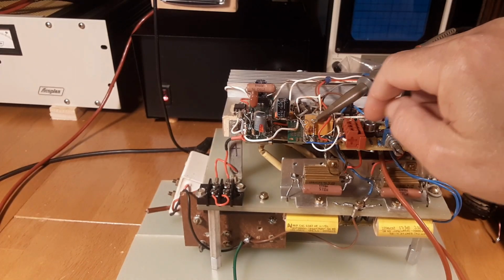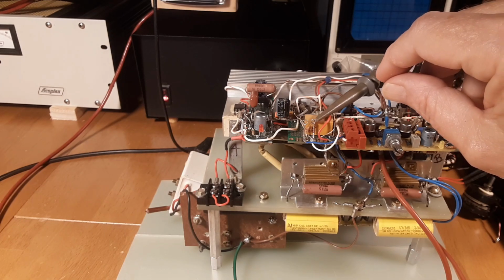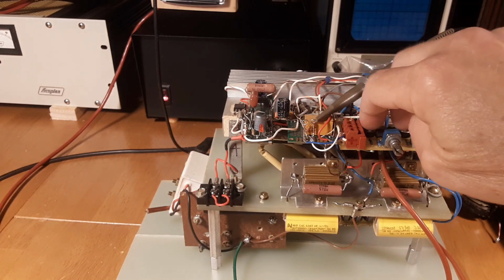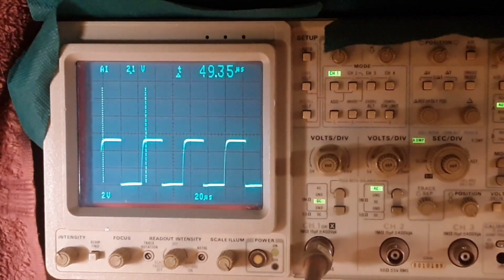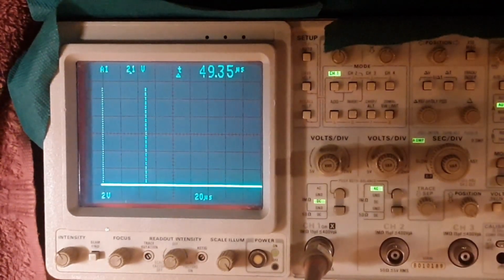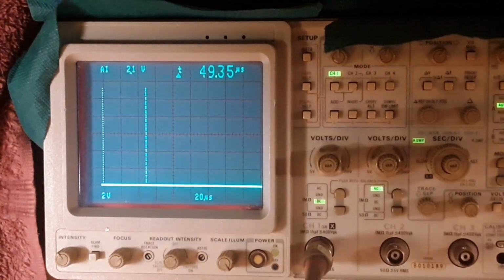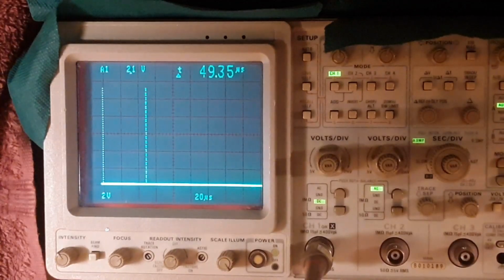Now, when you look at this, you've got to kind of overlook a lot of stuff because it's got a lot to it. But it's actually very, very simple. So we are on one of these collectors. I'm not sure which. Really doesn't matter. So we power it up. So there it comes on. The amp meter goes up. You probably hear the little click. And you see we've got drive to the gate drivers from that astable oscillator. But as soon as we try to arc it, boom, there goes our astable. It just shut the bed.